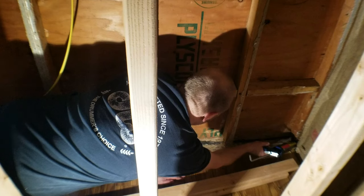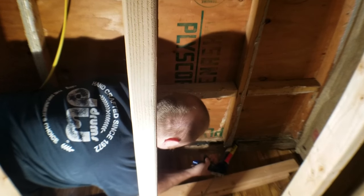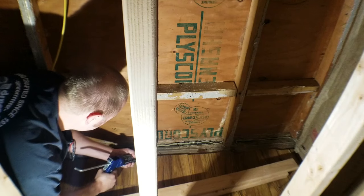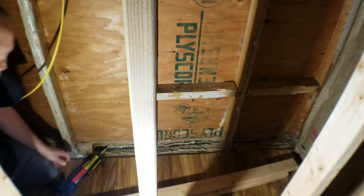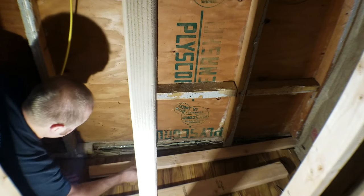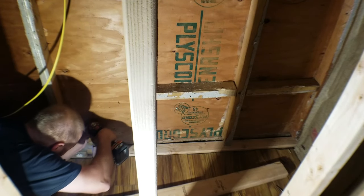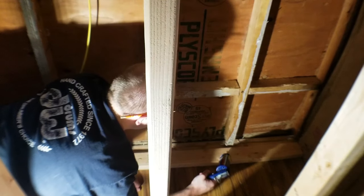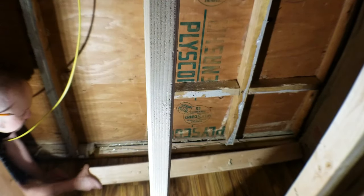As I said earlier, there's one more piece of wood in here that I didn't have to replace. Since this wall is going to be completely rebuilt in the near future anyway, I'm not using pressure treated here — mainly because I didn't have any on hand and didn't feel it was necessary. But if you're doing a repair like this, especially going down on top of concrete, you definitely want pressure treated, and you'll also need a way to fasten it to the concrete — either tap cons or some other hardware. This is one of those moments where I was glad I made the temporary wall slightly taller, because it pushed the studs up so I had plenty of room to just slide this piece of lumber in.